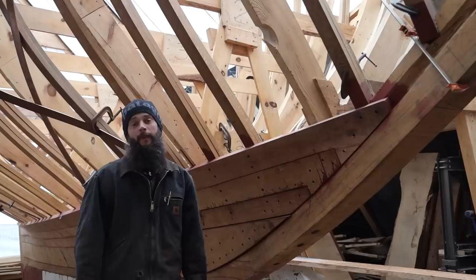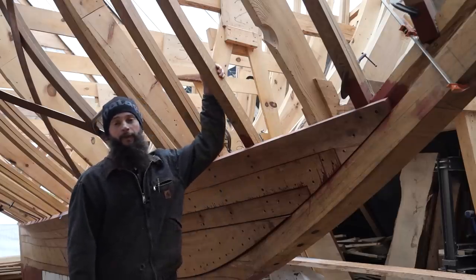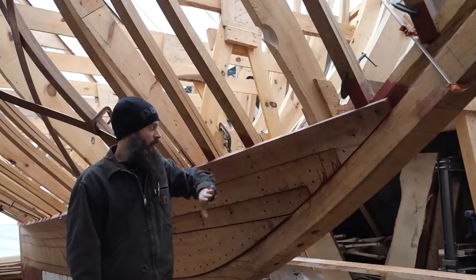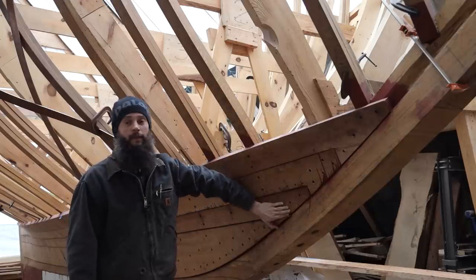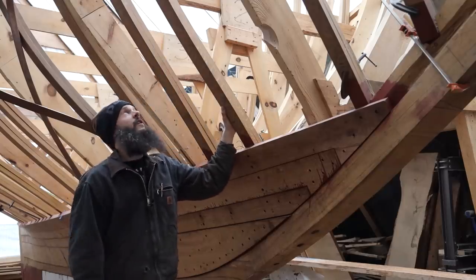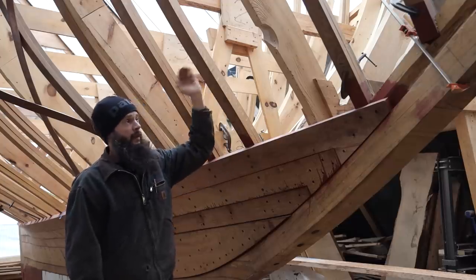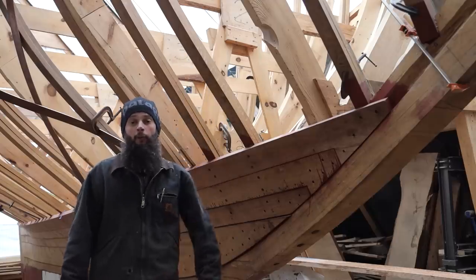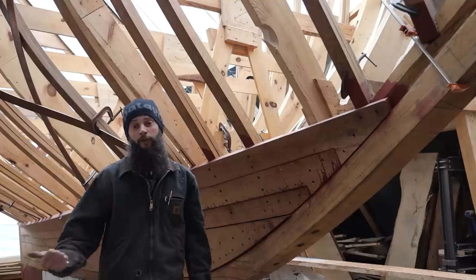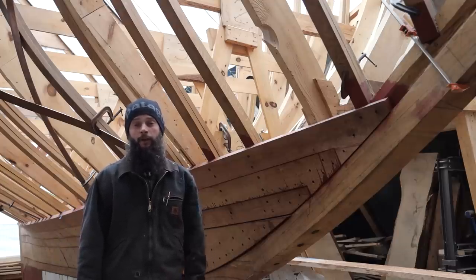So what are bilge bands? Bilge bands are basically interior planking — a run that goes on the inside of the boat from stem to stern, and they help support the flat run below the waterline. Where the boat is down low, we're tied into the stem, stern, and keel, and where we see the turn around the waterline, those curves are actually stronger and better supported than the straight runs. That's where the bilge ceiling goes — just on the inside from stem to stern. We want to mark that before we start putting on any more planks. We can check out Bud's book to show you why.